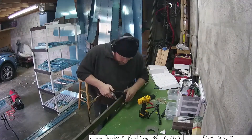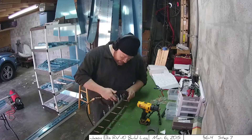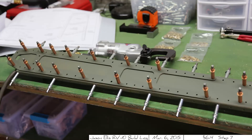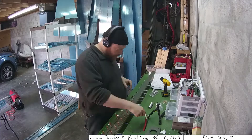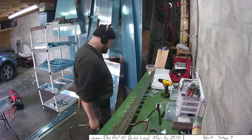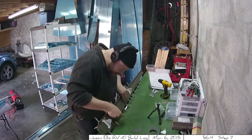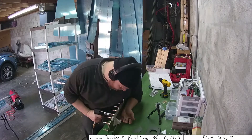This was fairly painless, actually. I only did the top 12 or so rivets, but it was a really good start. Once I got into actually riveting the rest of the rear spar, it became readily apparent that the squeezer wasn't really going to work because the throw from the edge of the piece to where the actual rivet was going to be was just too far. So I had to pull out the tungsten bucking bar and the rivet gun and get after it. Worked out really well.